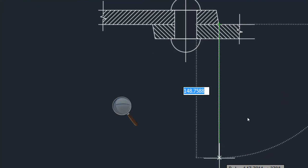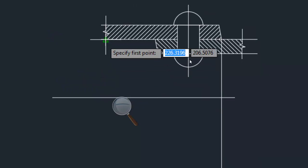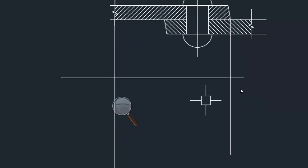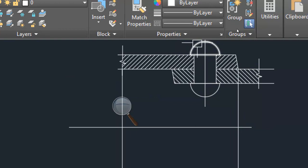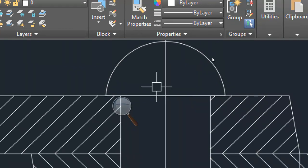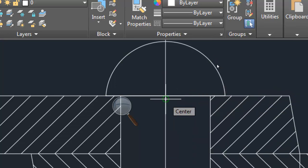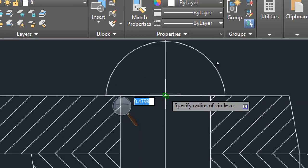Top plate is visible first, right? So take top plate. Top plate starting point I'll take it here. Then top plate it's ending somewhere here. At some convenient distance I'll start marking the holes. So how is he showing? He's showing the outer and inner diameters — they're visible in the top view, right? So take a circle. This point is the center — don't take the bottom. Center of this you have to choose. And draw a circle here.